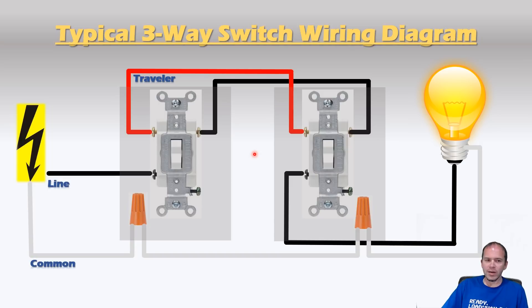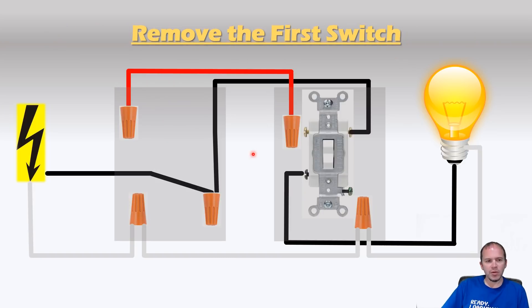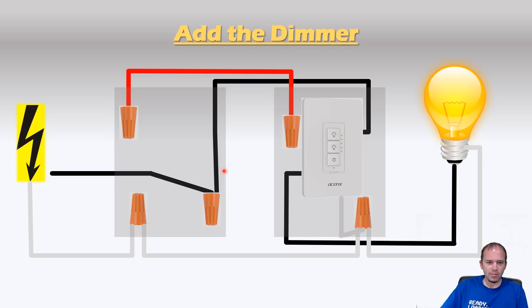If your switches aren't wired like this, you may need to consult the three-way switch wiring diagrams in the description below. I'm going to show steps on the wiring diagrams on how to convert this over to using one smart switch and one dimmer. First, remove the first switch on the left. We won't be using the traveler anymore, so put wire nuts on the traveler on either side so it's not exposed wiring. The hot will get wire-nutted and go over to the switch that controls the light. Once you've made sure that switch works, swap it with the dimmer — you'll have your line coming in, then your load, and you will have to tie in the common.